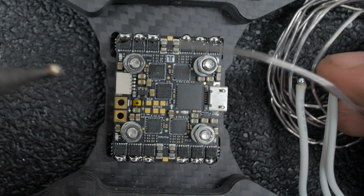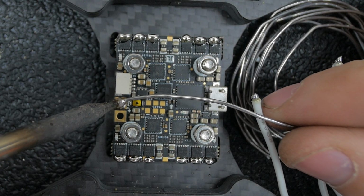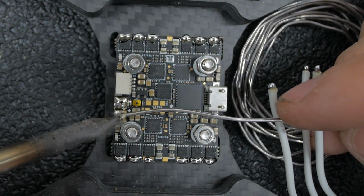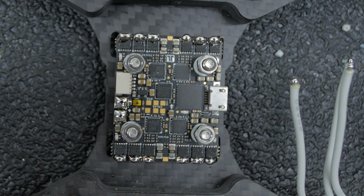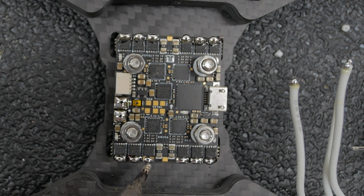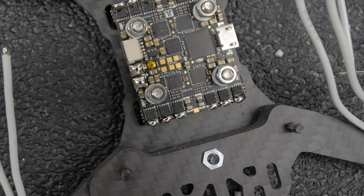So to anyone who really struggles with soldering, tinning is your trick. Even when the wire seems like it's not doing what you want it to do and you're panicking, sometimes adding more solder actually helps. It will help everything reflow to where it's going, because there's flux in it, so it kind of yanks it around and makes it better. So we got everything tinned up.